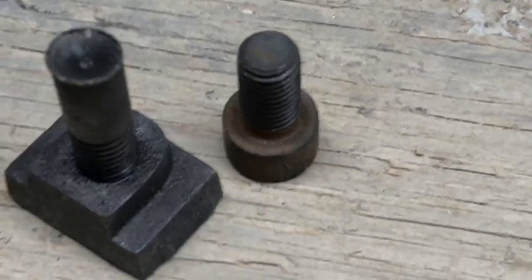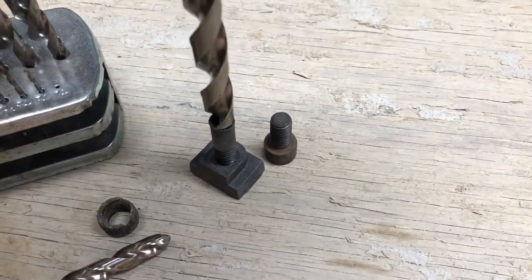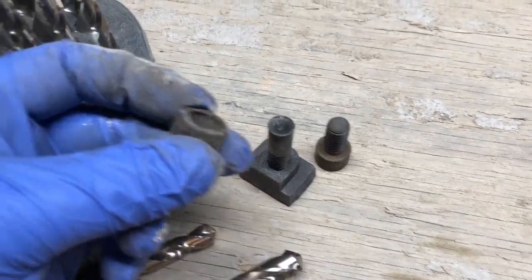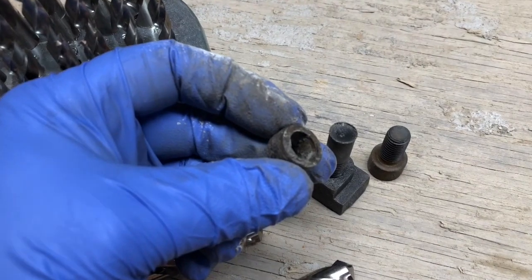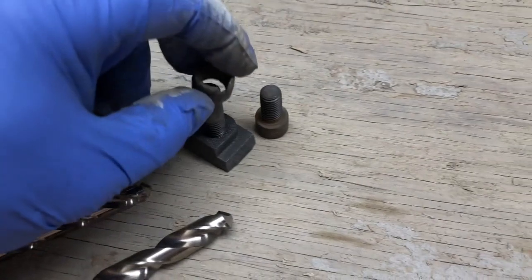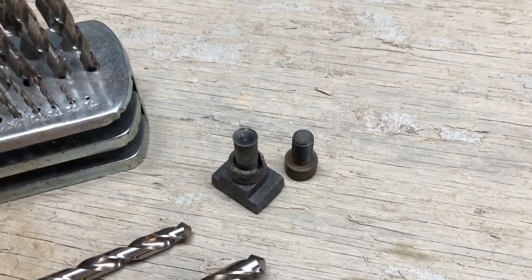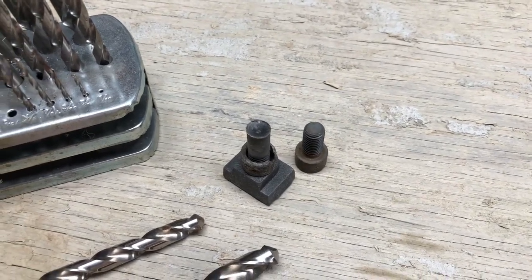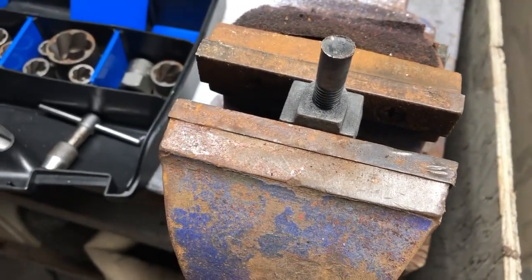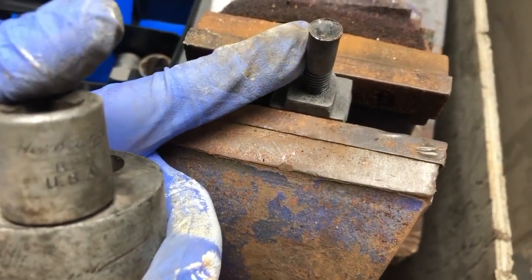Look, it's right in the center. I established it with the smaller drill, then I went in with the larger drill and would follow the one that I originally had until I drilled the head off. The edge just breaks off. Then I snapped it off. That's another way of removing a bolt without actually doing any damage to any of the material around it, because I wanted to keep the vise in good shape. I could just grab it with vise grips on the end — not a problem.